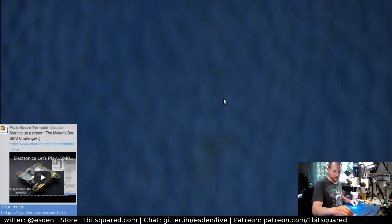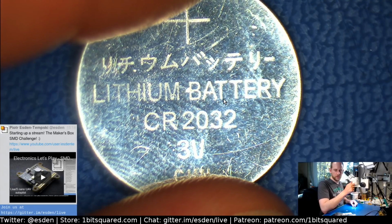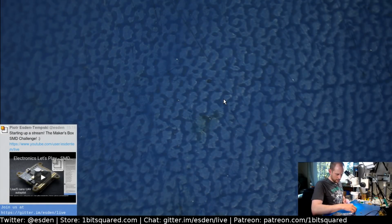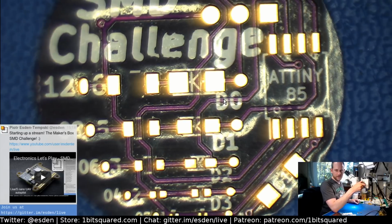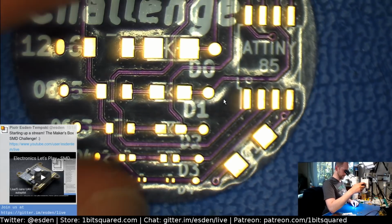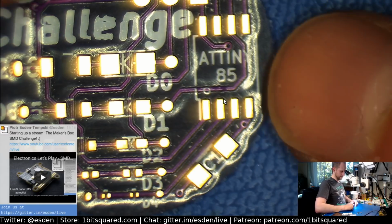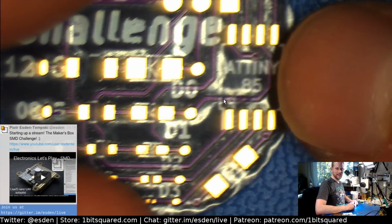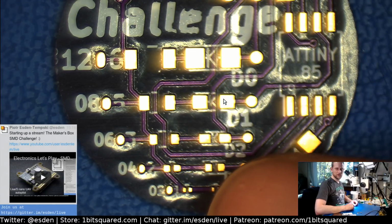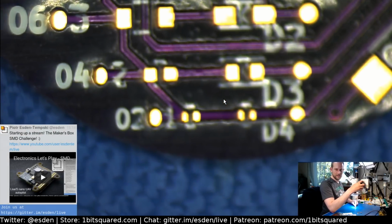One thing we have to provide is a battery. I found the battery, a CR2032 3-volt battery. There's a holder here, and there is the PCB itself. Now let's try to focus. It's a little bit overexposed because of the gold pads, but that won't be an issue. As you see here, it's an SO8 part, with my dirty fingernail next to it. It goes from 1206 parts down to 0201. You see this is quite tiny, and the other kit is even smaller.